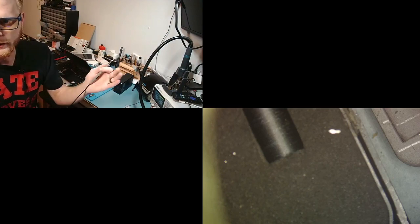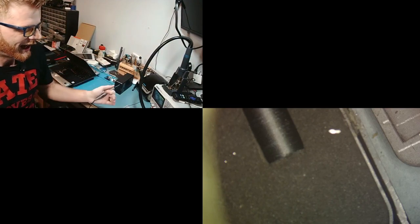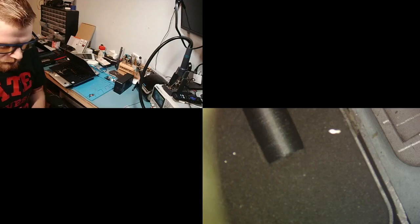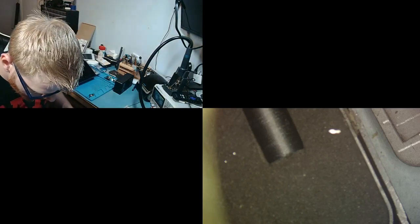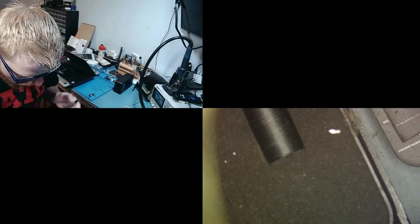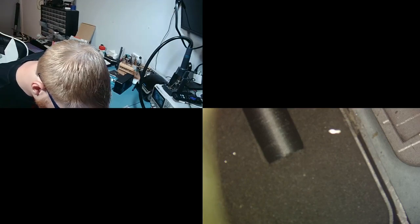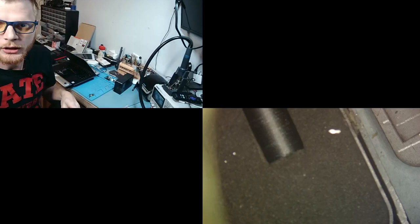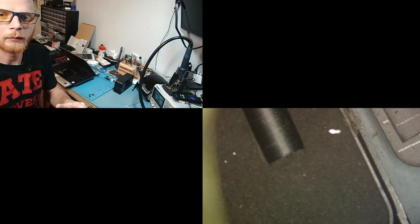And you can't see it because of my awful camera work, but I can see it. So we're gonna do what Louis Rossmann says is the trust-based DC power supply. You're gonna have to trust what I'm telling you it's pulling. All right, and now I am going to go ahead and inject right into main. I'm gonna see what I get. And I get pretty much as much current as I will allow. So everything that I'm trying to inject is going into the iPad.